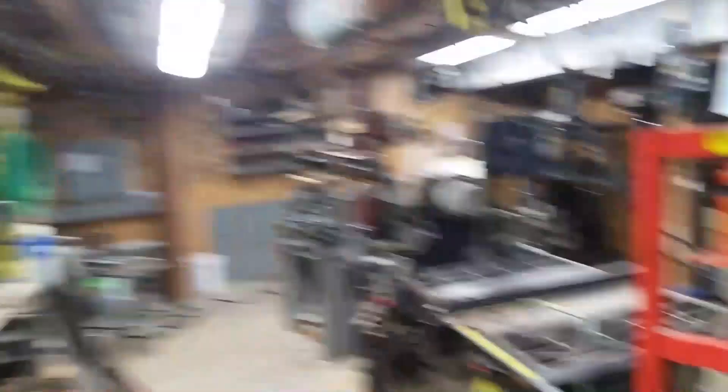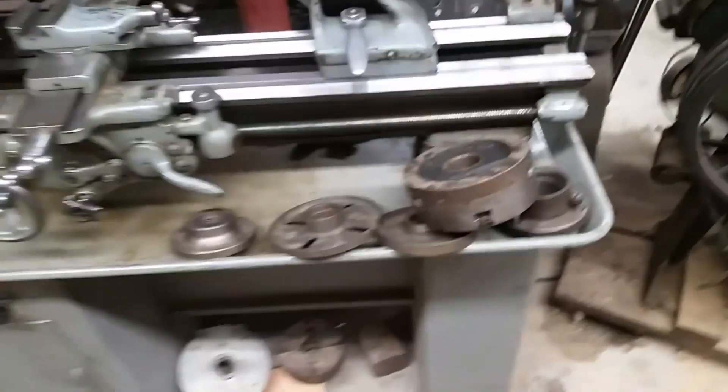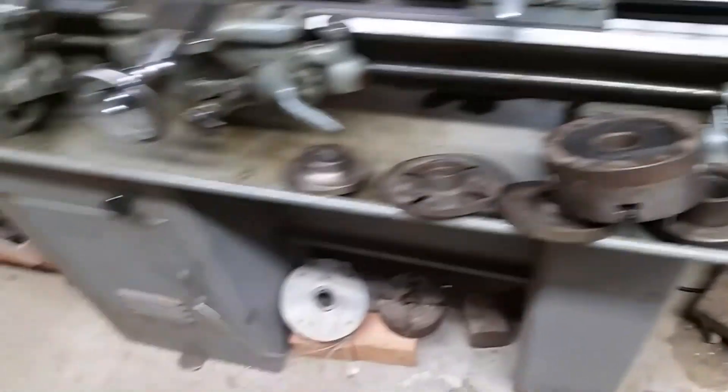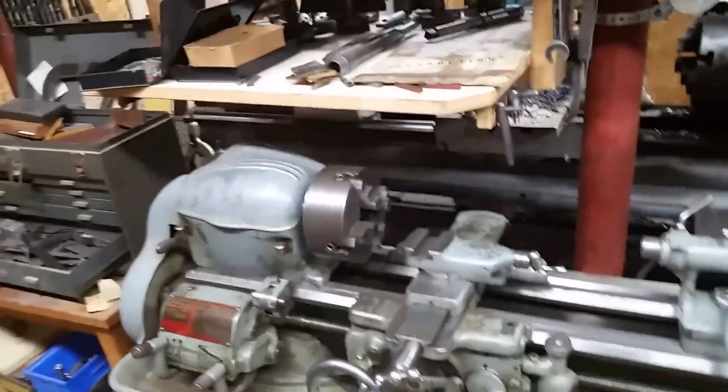Anyway, that's the quick runaround - more tools than I can keep maintained. This really nice South Bend lathe only had a four-jaw when I got it. I have a three-jaw and I'm thinking of taking one of these backing plates and making an adapter. I've been hesitant because I hadn't found a good way to do it, but I think I've finally come up with a procedure. There's another faceplate and another four-jaw down there.